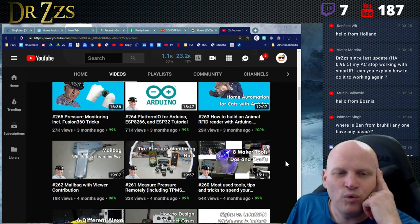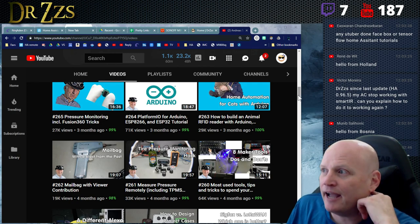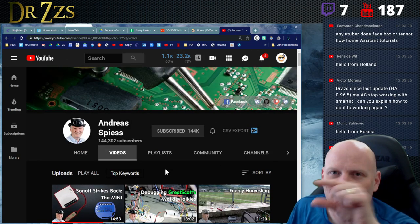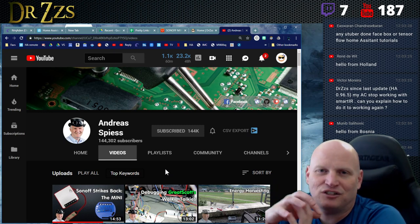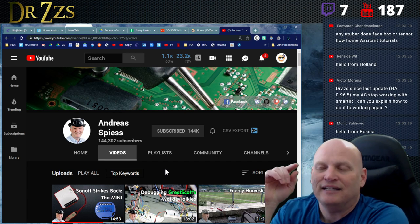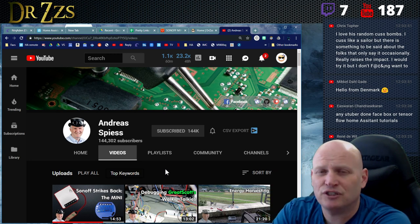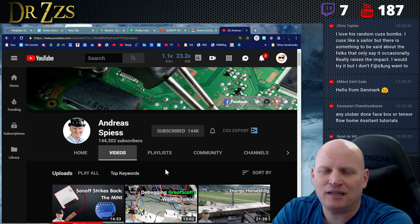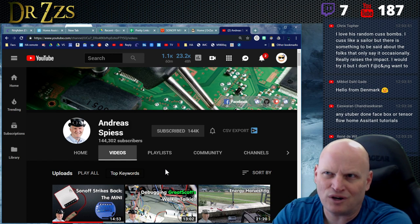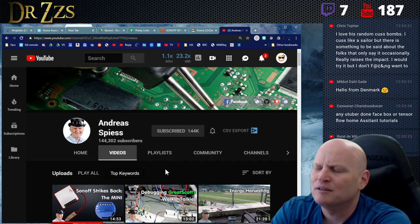See, that's the thing. If you watch his video about the Sonoff Mini, I put a link to it, and I told him this in my first little message to him. I said, hey, I also put a link to your video in my video, because there's a method through the DIY mode on the Sonoff, this new Sonoff DIY stuff. There you can do REST API commands. So HTTP commands you can send to the Sonoff, and I assume you can get information back. You can request information. I don't know.